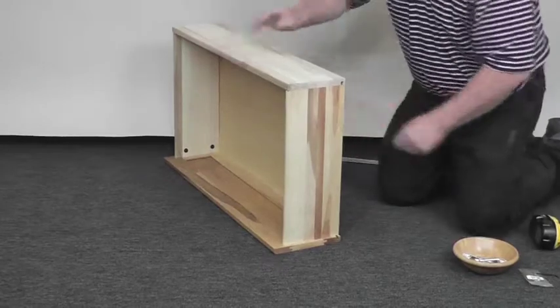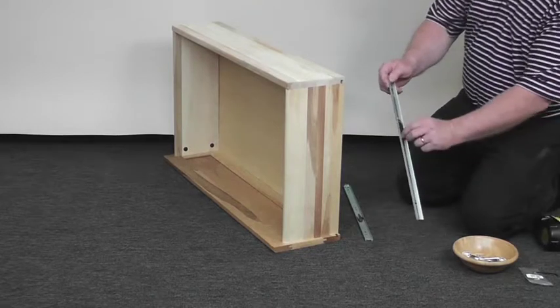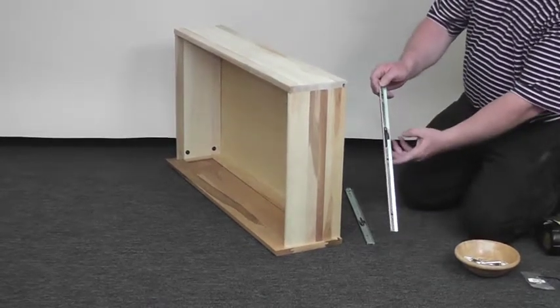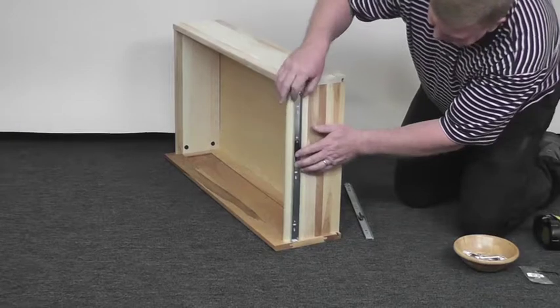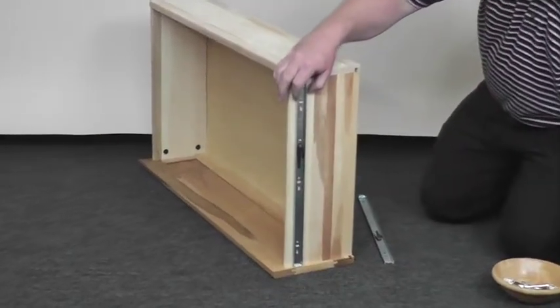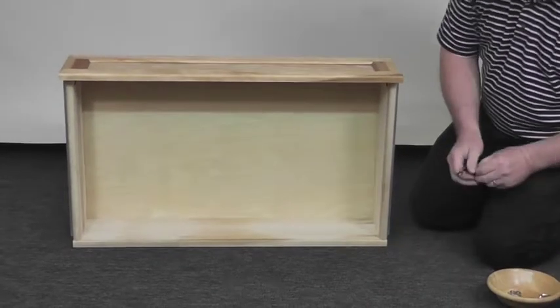Now, I'm going to fasten the drawer glides. These are the pieces that we had pushed the tab and removed before we did the opposite side, which fastened the side panel. So this has a tab on one end that goes towards the drawer front. And you'll see there's a hole here and a hole here. 3/8 number 8 screws. Then we're going to fasten the handles.